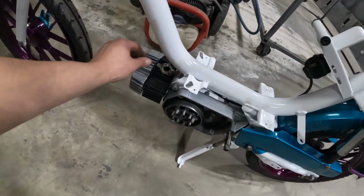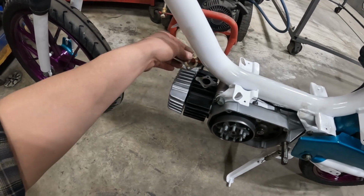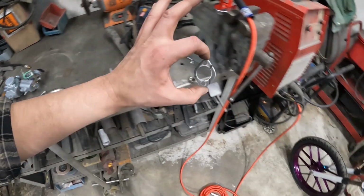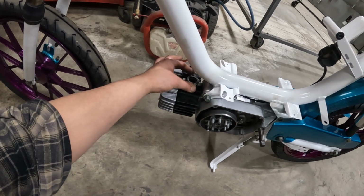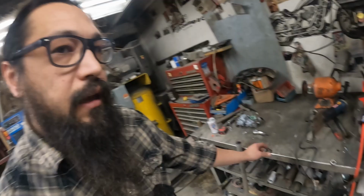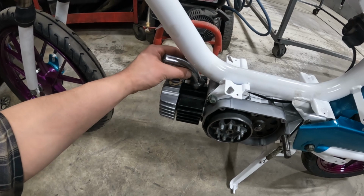We need to do the intake. So where we left off, got this set up. Intake gasket will sit here, and we are going to start at the base first. So here's kind of what we did. I took the handmade intake flange. This drops down here and gets bolted in with some M6x1 hardware. So that bolts on, centered up really nice. And then I took a set of 7/8 handlebars and cut them down a little bit more. Essentially, this will sit just like that.